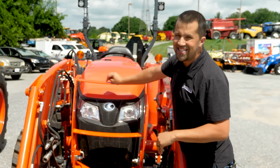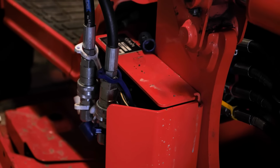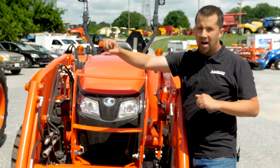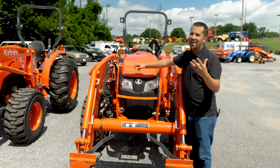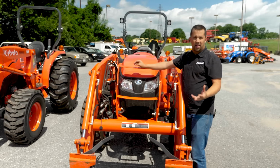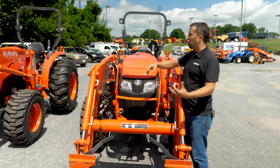The downside to that type of valve, again, where you're going to find the valve body out here on the torque tube, is that in order to operate it, you have to simultaneously operate your loader bucket curl function while pressing buttons on the loader stick in order to operate the diverter. While that's very possible to do, and it gives you some flow control out here as well, it is a little bit more complicated. That motion of having to throw the valve and press the button is not nearly as natural as the other style of valve.